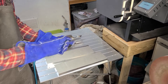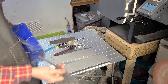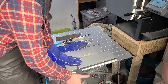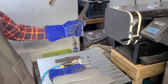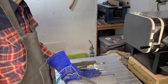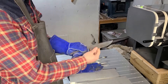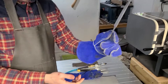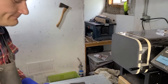It's amazing how quickly it can cool down on aluminum. The spine is a little hot. That's the nice thing about the plate quench — when you quench it in oil you have more chance of warping, but the plates don't really let it warp because you're squishing it flat. This is a real thick steel anyway — we're talking about three-sixteenths or so thickness.